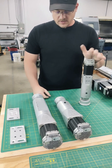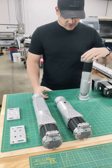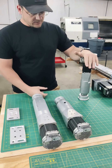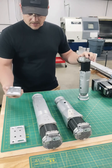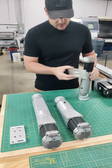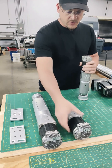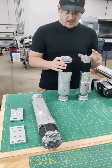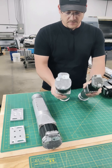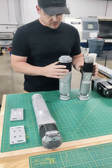The DK2 is a great product — this is our introductory product. It has a 500-pound capacity. It comes with these half-inch brackets, which are included as you can see, and the smaller motor is kind of like an S2000 motor. Compared to something like this, which we liken to a V8, you can see that the larger frame of the motor will give you more torque and a better motion profile.